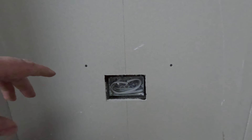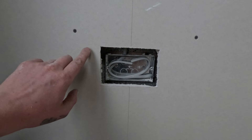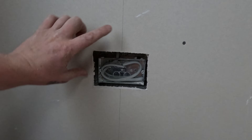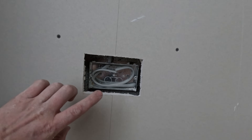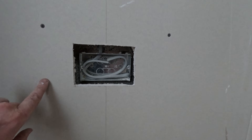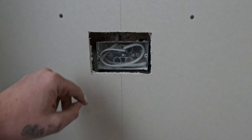We've got some plasterboard and we've obviously got the ply. I'm going to cut this bigger so we can get a piece of plasterboard cut to this size. Same thing — we'll do some plywood up and down, size that up exactly where we need it, then cut a new piece of plasterboard and screw it in, because this is just never ever going to work as it is — that's two fingers' worth of gap. I was going to do it and I just found out Adam's taken my spirit level and the multi-tool. Back outside then.